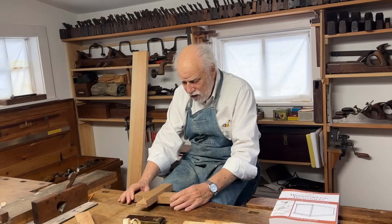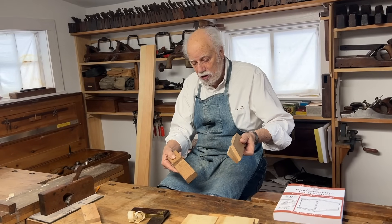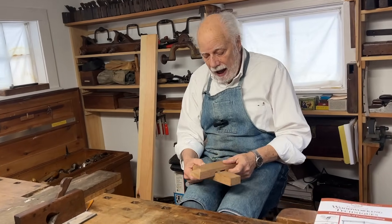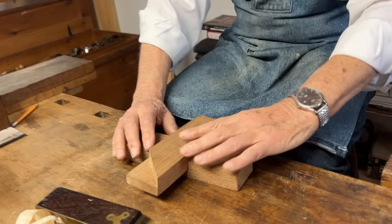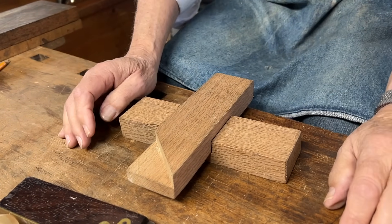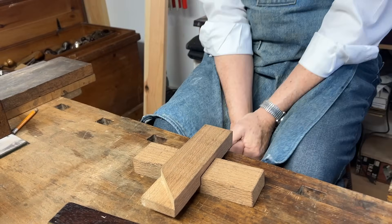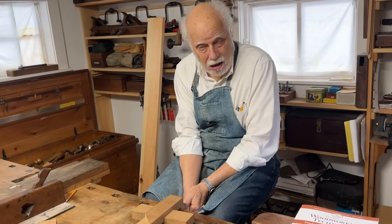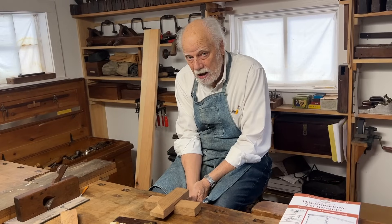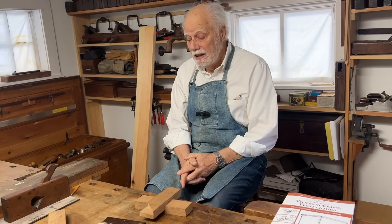The simplest way is something called a cross lap joint, and this is an occasion for me to point out the third great rule of woodworking: if you've got to join two or more pieces of wood together, it invariably helps to mark the pieces, because it's astonishing how many ways you can put wood together that you didn't intend.